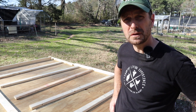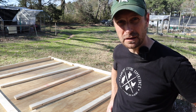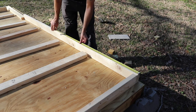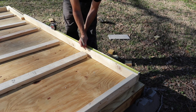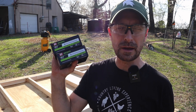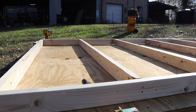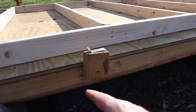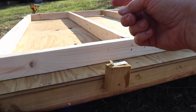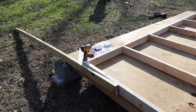Now it's time to get these walls together. What I'm liking so far is the wood that I'm pulling out of the kit itself is nice and straight and not a whole ton of big knots. It's not great quality lumber, but at least it's 2x4 and it's straight. All the walls in the shed kit are 24 inches on center. What's cool about this Heartland shed is they actually give you Grip Right branded boxes of nails inside the kit. I'm going to lift this wall into place — it's not that big, it's only about six foot tall. I've screwed in some blocks at the edge of the rim joist and that's going to prevent the wall from slipping out when I lift it up from the other side. I've also got a brace here to prevent it from falling back on me. Whenever everything's up, we'll attach it to the floor.